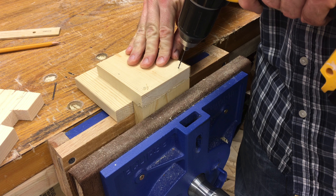Now I'm going to put my finish nail right there, making sure everything's lined up. The glue is setting up so I'm not moving anything anymore — I'm just going to hold it at the sides and drive that nail down. Make sure you drive the nail straight because you don't want to blow out the side one way or the other. Sometimes if your pilot holes are off a little bit the nail will want to go that way, so you have to guide it.